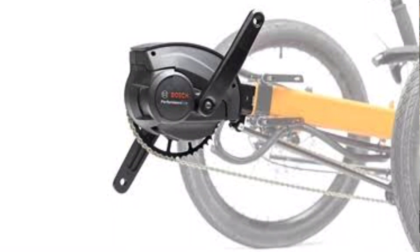One of the favourable qualities of the Greenspeed Magnum is its low bottom bracket to seat ratio. In other words, the bottom bracket is low enough that you can see over the top of your toes. This is probably one of the deal breakers for many recumbent trikes when designing a Roto-Valoe fairing to fit them. But the Greenspeed Magnum has quite a low bottom bracket and lots of seat adjustment, which means it packages pretty well. With electric assistance, the size isn't really a concern, and indeed the focus of this velomobile is to reach riders who maybe don't fit into existing velomobiles and already love their Greenspeed Magnums.